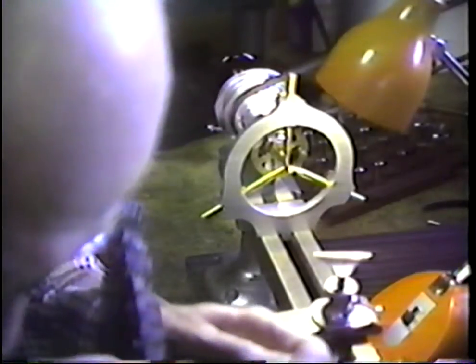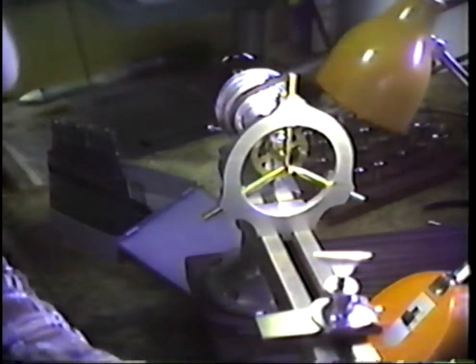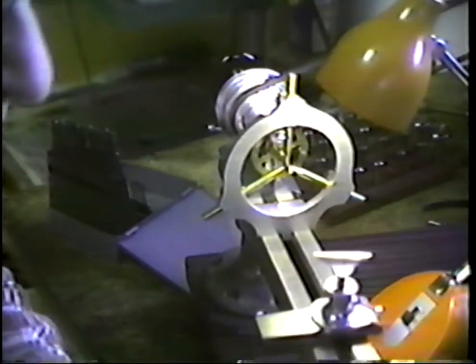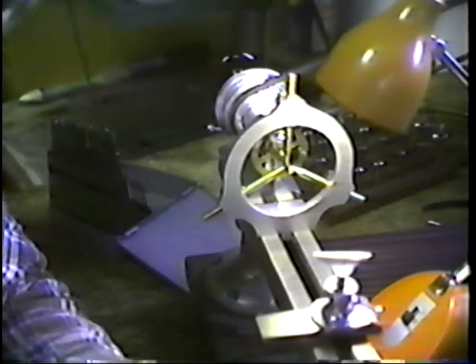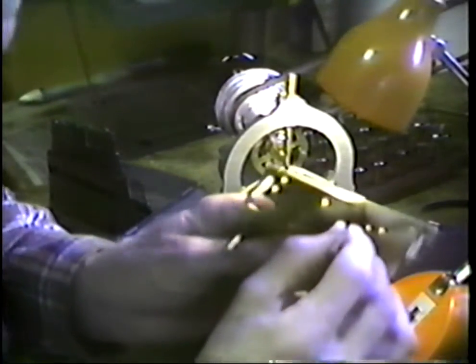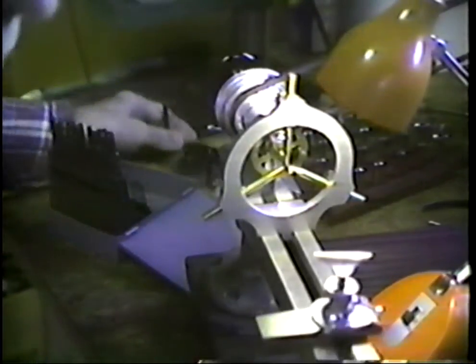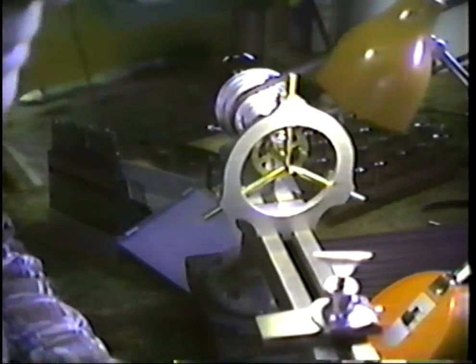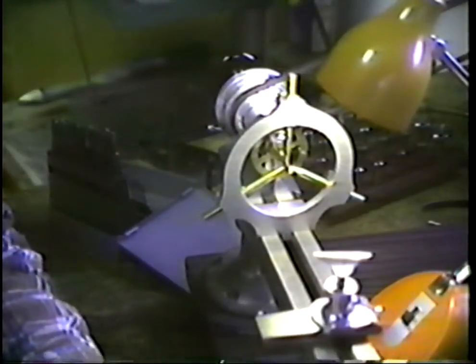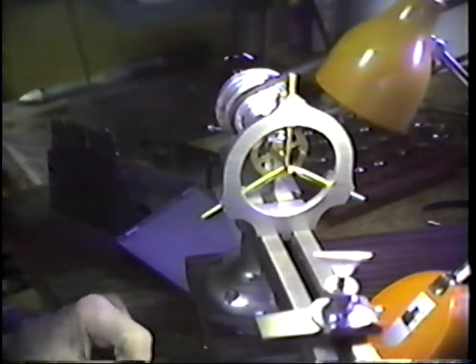This bit is 73 thousandths that we have, and that exactly fits that hole. That goes right in that hole. The chucking shank of it is 73 thousandths. Well, is that what we want to pivot? Let's measure this and be sure that we're okay here, and I'm measuring about 72.5 on that. So that gives me an idea of where I want to go.